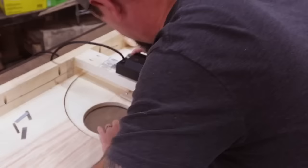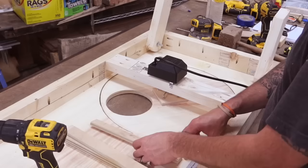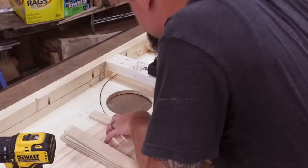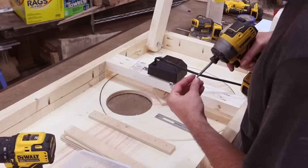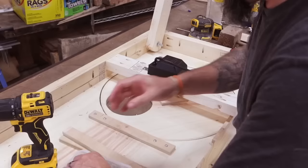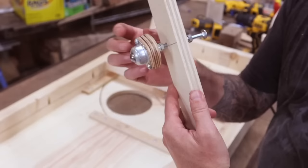Line up the opening in the motor to the square stock and slide it right over. Once in place, lock the motor down with a couple of screws on the side and a couple in the back. Now install the star circle supports, part H — these support the circle from underneath so that if a bag hits the very edge, the motor won't take the brunt of that weight. All four supports should be installed with one-half inch of overhang onto the circle for plenty of support without too much friction for the motor.